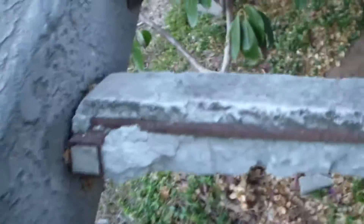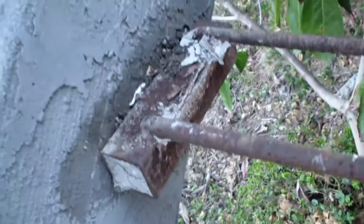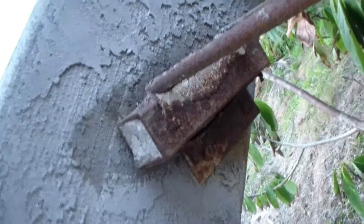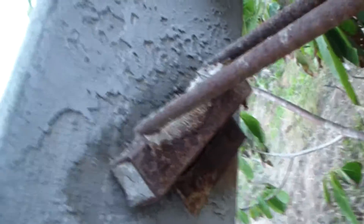Now I'm going to take a jackhammer and get rid of all this concrete and reuse these rebar forms. Let's take a look at what this thing is. This is a 2-inch by 2-inch stock and it's 8 inches long. Underneath it there's some 1½-inch angle iron, 6 inches long, with two holes drilled in it. And then of course we have a ½-inch rebar coming across. So those are the three items you have to buy and fabricate and weld yourself if you're going to start from scratch.